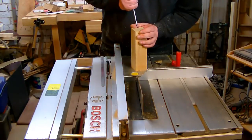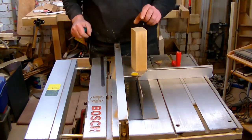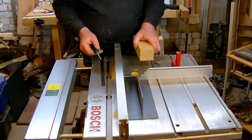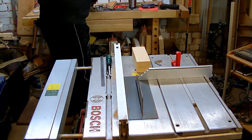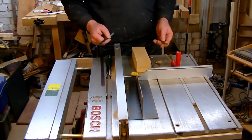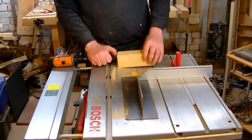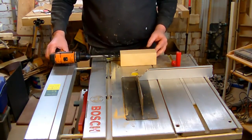It's not necessary that this is super accurate at this point, because the only things which have to be really accurate are these two faces — the one on the top and the one on the bottom. So now I'll go ahead and drill a 10mm hole right through. I'll start with a short drill bit on my drill press, and then I'll come back and use this long drill bit, which actually goes all the way through. I go ahead and finish the hole with this long drill bit.